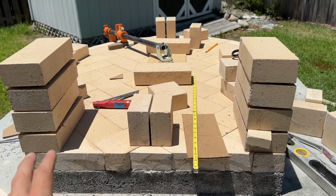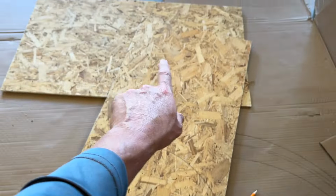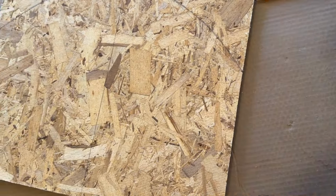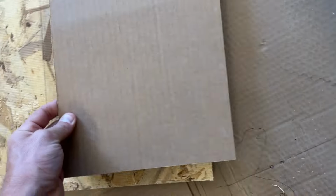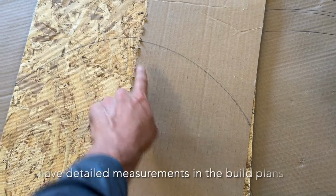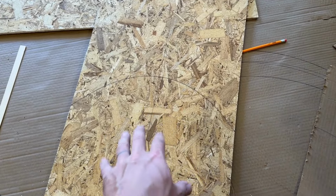And then I finalized the doors. I just gotta build those molds. To make these arches, I'm just using the leftover plywood from the base mold. Did some rough drawings. I was using a thin piece of wood to bend to get the arch, but it didn't look very even. So I'm just gonna make a template out of cardboard, just free-handed it, looks pretty good to me. I'll flip it over and trace it, that way I know it's symmetrical. I'll make both molds the same way.